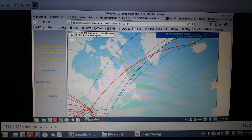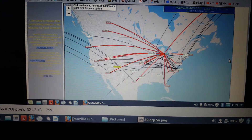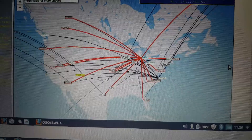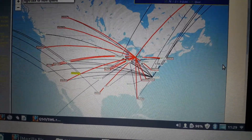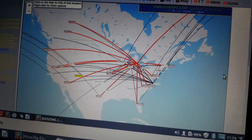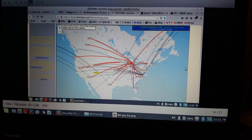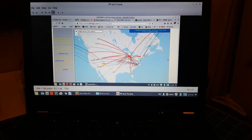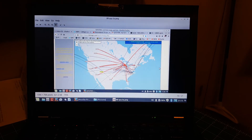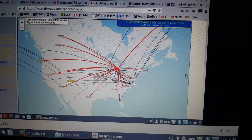QRP — 5 watts, NFED half-wave. No ground needed. No tuner needed. Coast to coast coverage. No coil on the wire, Gil. I wanted to mention that particularly because there's no coil to get damaged, ruined, or lost and unable to be replaced when you're out in the field. Whether you're out for the afternoon or your life depends on that thing — no coil. Any piece of wire will do. Go into a house, strip out the wiring, and there's your antenna for the rest of your life.